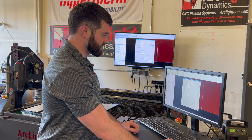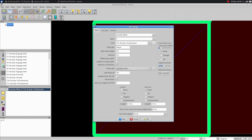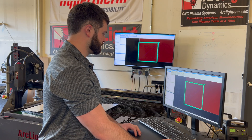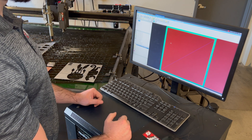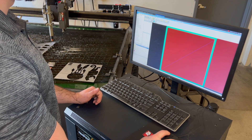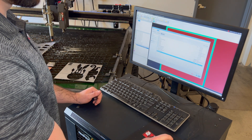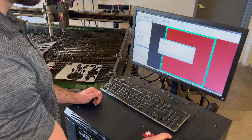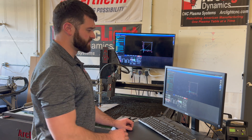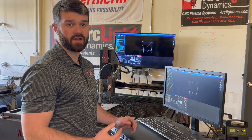I'm selecting my 45-amp quarter-inch aluminum tool, which is close to what we're cutting — it's a little thicker, so we're going to start dialing in our feed rate as soon as we get this in. We've got our tool path on there, I'm happy with the operation, so I'm going to go ahead and post-process it.